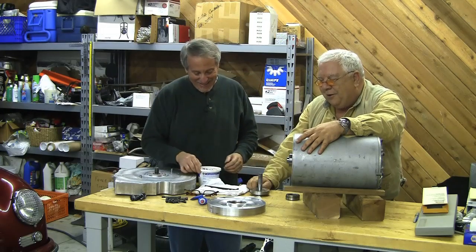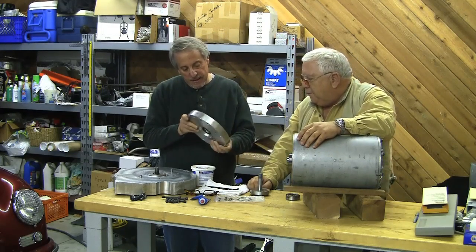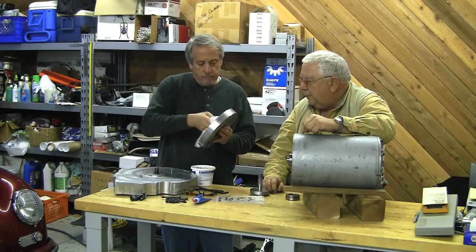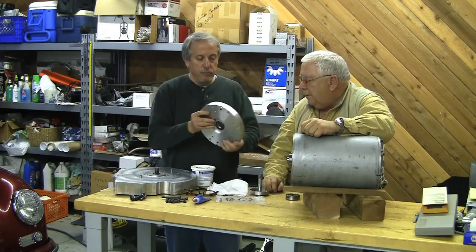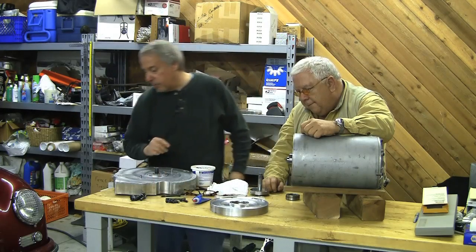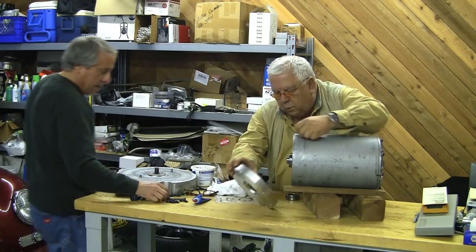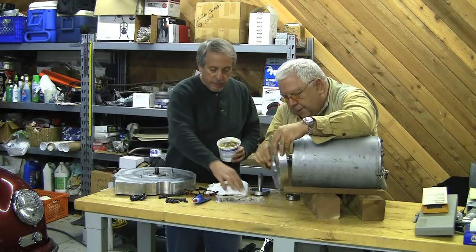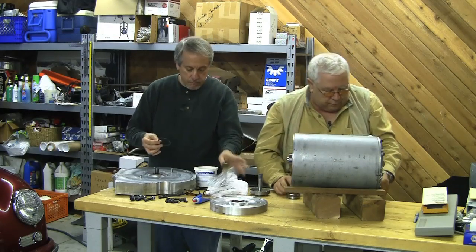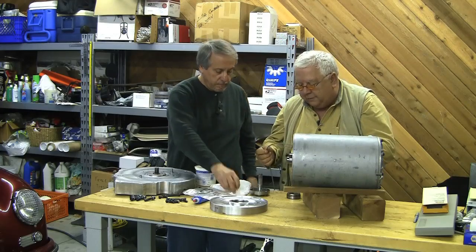We're starting to gain some ground talking to sponsors, which is what Brian does — we're getting some interest. I think we're just going to inspect this first, make sure we don't have any shavings in here. I've got top marked here, just clean that up and make sure top and top — so that's where that's going to go. Then we're going to have to put five of our bolts. We also have this wavy washer, and the sensor bearing — we already have that run through. It came with a shorter cable but other than that it was the same sensor bearing, 233.